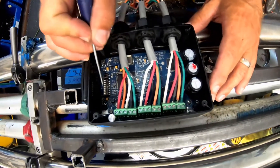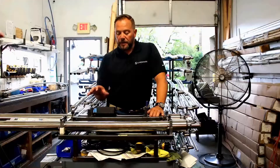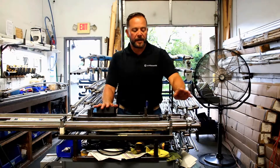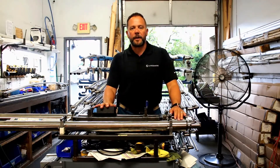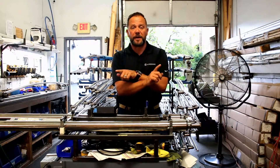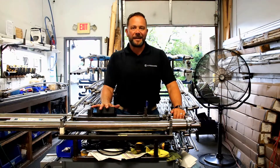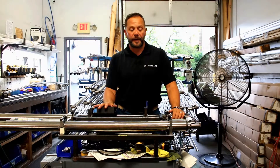Once you get it back to one inch, turn six off, seven on, reset, turn it back off — now both actuators are parked at home. I want to explain why that happened. The reason why you cannot retract the starboard actuator is because the controller has not seen it move. It's still hooked up and everything's fine, but if the encoder has failed, it's not communicating with the controller. The original school of thought — and myself included — when you think about it, the port side started to go and stop, the starboard kept going, so you'd think it's the port side that's bad. It's actually not, it's backwards. Your port sensor is still communicating with the controller, so the controller and the port sensor are looking for the starboard. They didn't get anything from it, so they paused. Your starboard one is just taking off on its own, going its merry way, because the sensor is no longer working — it's operating on its own.